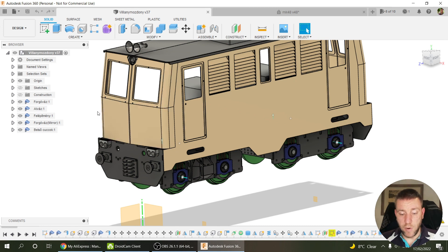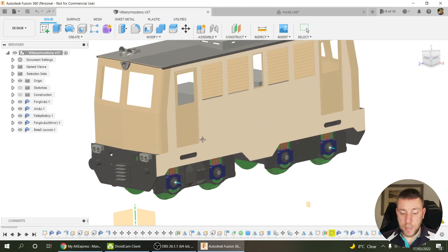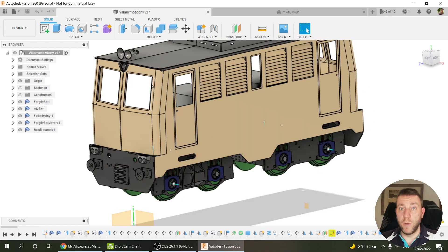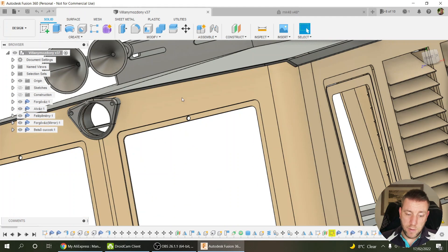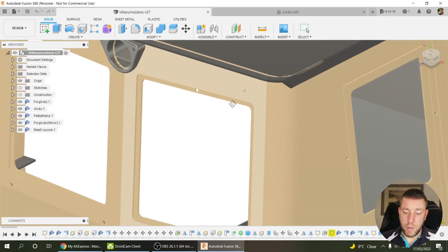So this is something I still need to bend, and I'm probably going to use the help of my friend. I've designed all of these to be a 20mm radius, so we'll probably take some pipe as a bending form. A friend of mine has a press. There are like four plates that need to be bent, but everything else either doesn't require bending or can be bent with a one millimeter radius. In the roof profile I used a bend in the middle and a small one at the edge — both one millimeter radius — so the laser cutting company would be able to do those.